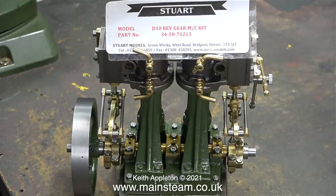Except for the usual problem: the slide valve was not a good fit on the crossbar — it was too tight, which held the slide valve off the ports. Combined with the fact that the face of the slide valve itself hadn't been cleaned up, most of the air was blown to exhaust. That was a quick fix, by filing the slot a bit wider in the slide valve itself and cleaning up the face of it.